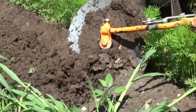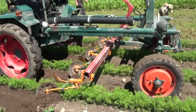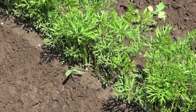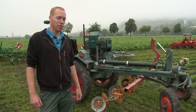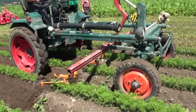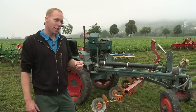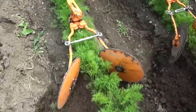The bed disc weeder is ideal in the early stages of raised bed crops. A standard toolbar is equipped with discs fastened to parallelograms for cultivating carrots. By rounding off the edges, the implement reduces the area that needs to be hand weeded and can be driven very close to the carrots. Precision steering and the right weather conditions are required for optimum results. The implement is less effective if soil is too cloddy or very dry, as large clods may be caught up and tear out the carrots. But with slightly moist soil and the right soil structure, the implement is very effective.